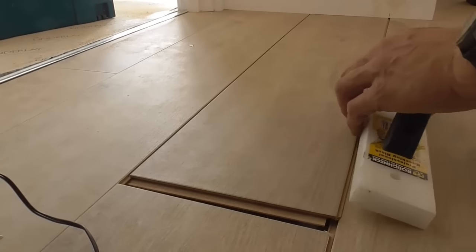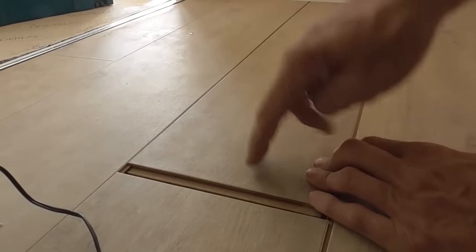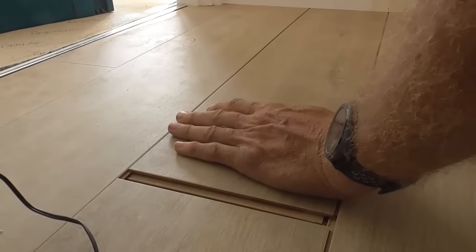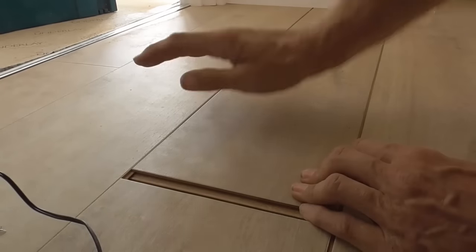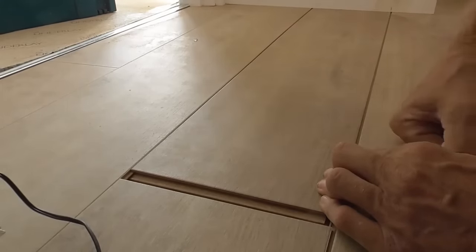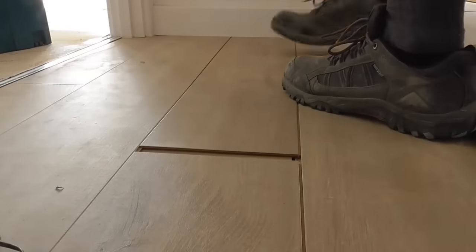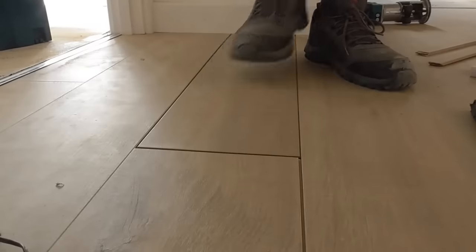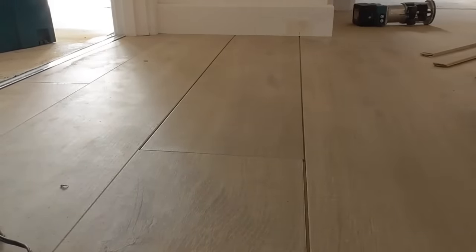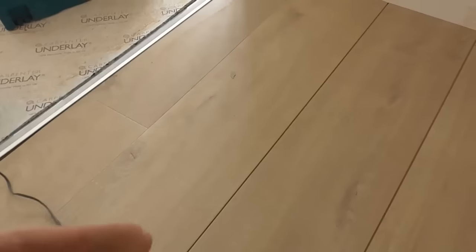It's gone! Excellent. Right, so that's gone. And what I need to do now is open this joint back out. The challenge now is getting this board this way. What I'm probably going to do — my shoes are nice and clean but they've got rubber soles — I'm just going to see if I can stamp it that way. Here we go — yes, it's going! Snap shut! Super! Oh my gosh. As you can see now, this is really cool — the board is in, this end is shut. So all I've got to do now is very carefully from this point over here and this point over here, tap that flooring back and shut these joints up. This side of the floor has got to come back a little bit and we can knock that from over there. Let's snap all that lot shut. I'm feeling really confident here — this is super-duper. Here we go. One more. Yes! Just tap the whole floor down that way. That'll do.